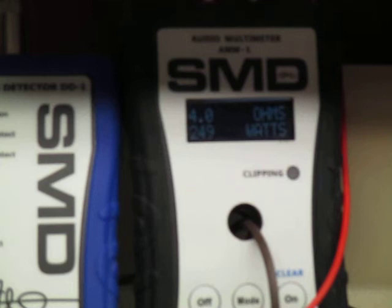Okay. Well, I've noticed something. Several of the amps that I test, they do pretty good on the dynamic power, but on the 40 hertz continuous test, they don't quite get there. And I think that maybe my power supply is just not quite big enough to supply the current from some of my amps, and that's why they're not getting quite as much as they should. I may have to get a newer power supply with more capacity.